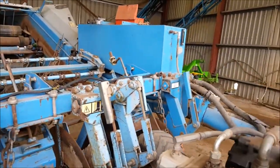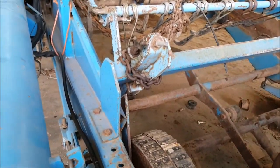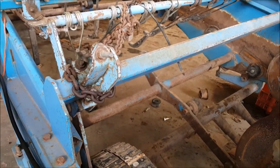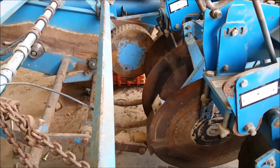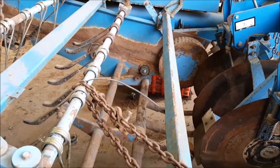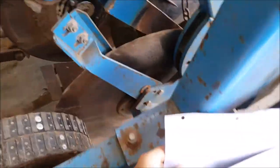You have your discs which will cut up the row, so you start cutting your soil up. The web we have on this is a 32-millimetre, which measures between the centre of one bar to the centre of the other bar. That's pretty much letting your tolerance of soil out — a bigger distance between them lets out bigger lumps of soil and probably some of your potatoes as well.